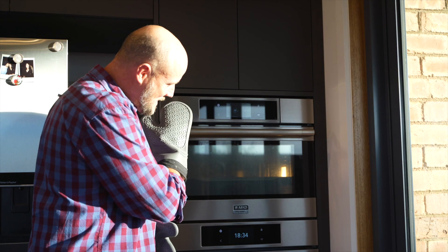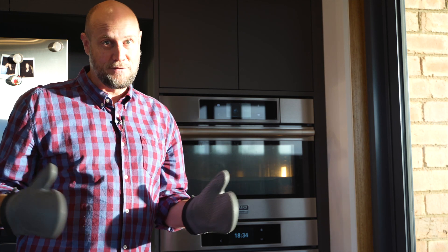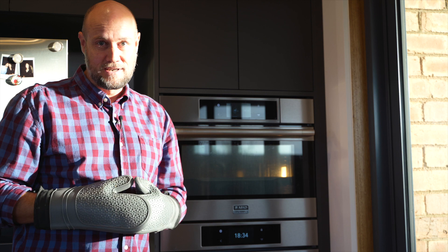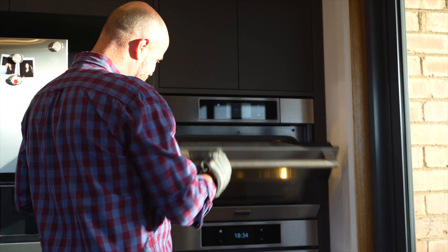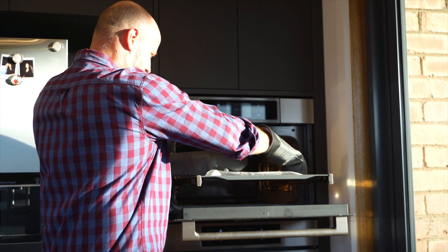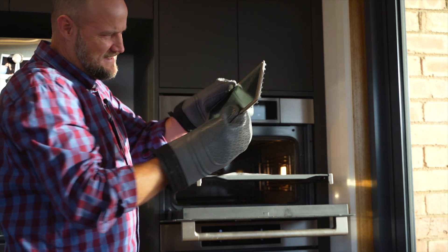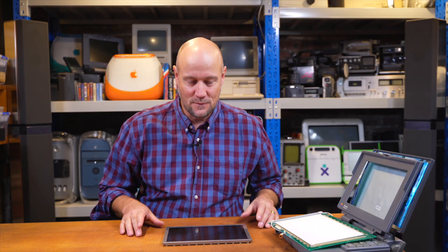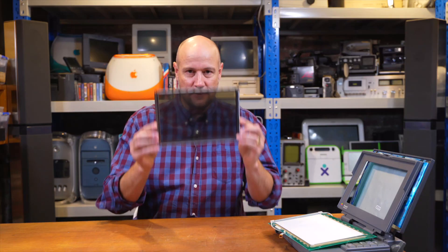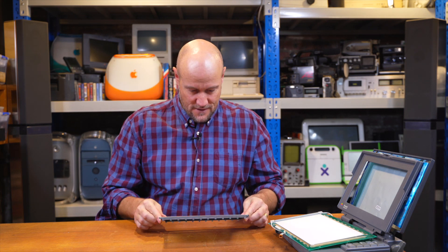The screen's been baking for about nine hours — that's all day. Hopefully that's driven out any moisture from that panel. It's time to get it out and put it back in the machine. We're back down in the basement with our freshly baked LCD panel and it is looking very tasty. So what we want to do now is put it back in the machine, but not just yet.